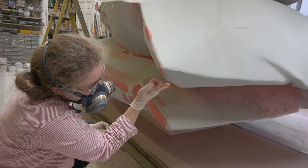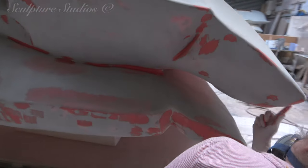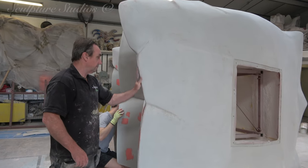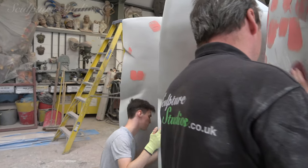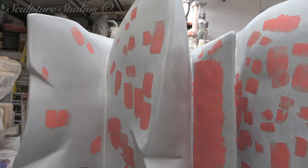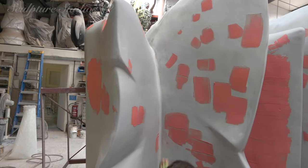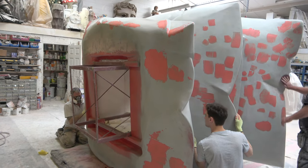To the home stretch now, and we're really getting picky. What started off as a blanket coat is now nearing a smooth satin finish, and that's exactly the finish of paint that we're going to use. We're going over with primers, and seeing the most minute of surface scratches, we're constantly working with finer and finer grades of sandpaper, until we go, yeah, that's the one.